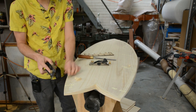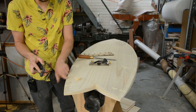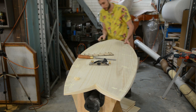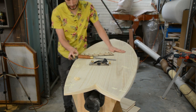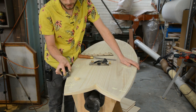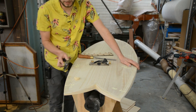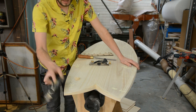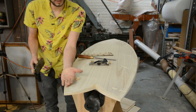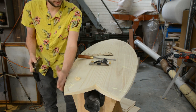You'll do this several times until the bevel is broadening out, then you'll start tilting your plane iron to a slightly different angle. So we're going to start at 45, then rotate it to a slightly steeper or shallower angle, and we're basically going to be rocking the plane over until we start to see a nice round over on the edge.